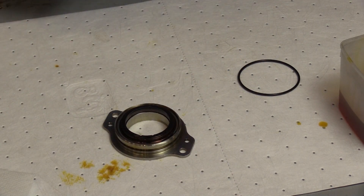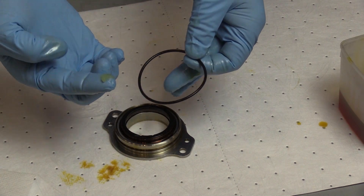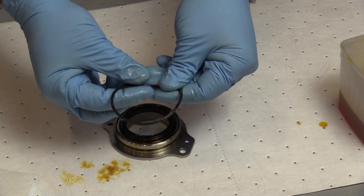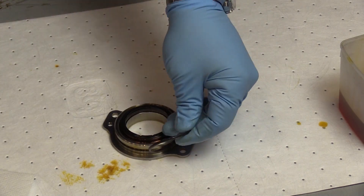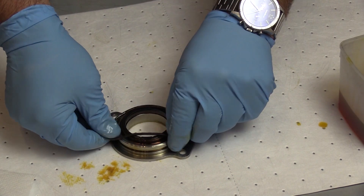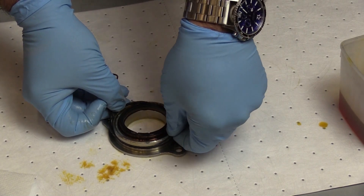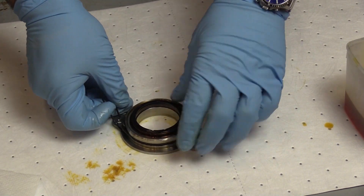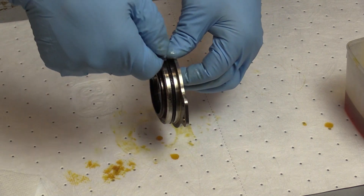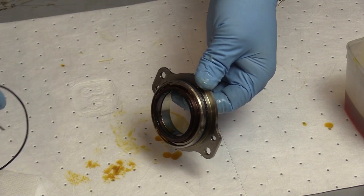Just like the mating ring, we're going to lubricate the packing of the carbon seal with white petrolatum, which obviously makes it a little extra slippery — which is the idea. I like to use a piece of discarded packing material and do a couple of revolutions around that O-ring just to make sure we didn't store any twisting energy in it. And we're ready for installation.